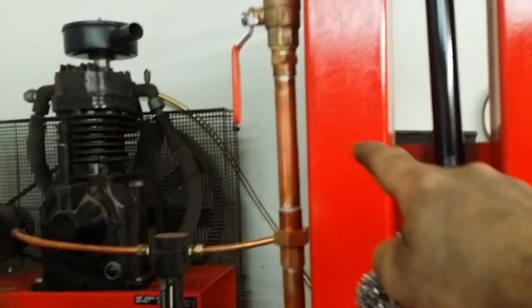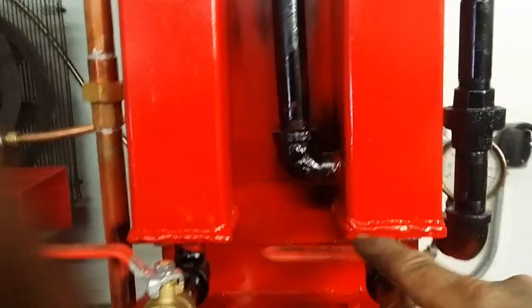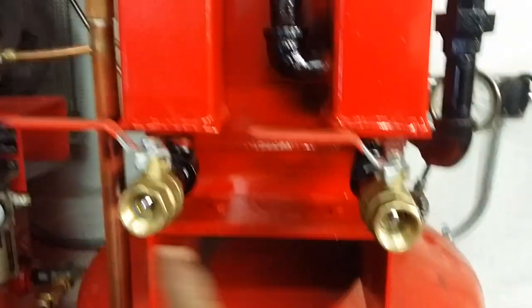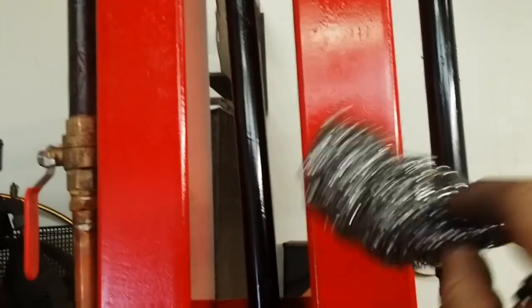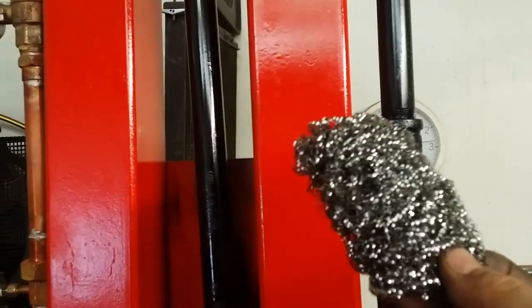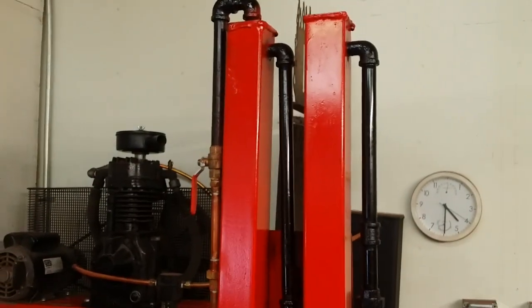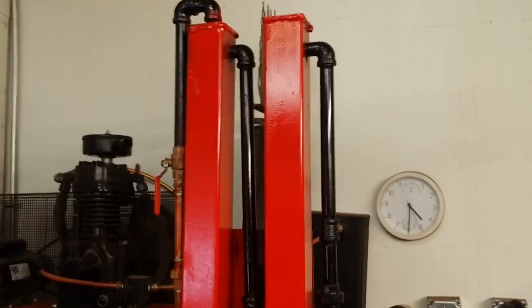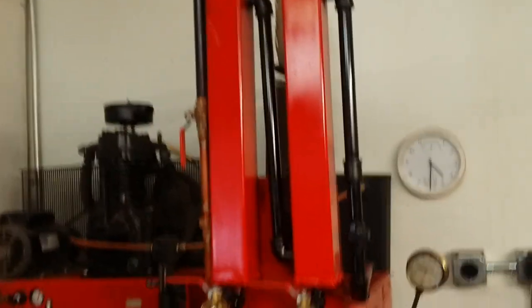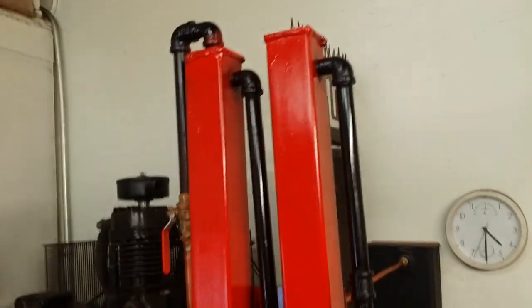As the air works its way up through there, it comes back out the top and drops back down to the bottom of the second chamber. I have two drain valves for the chambers. The second chamber is also filled with stainless steel scrubbies — really inexpensive, you can get a box full at Home Depot. This design is based on one that plain old Bill came up with; his is a single chamber, but I decided to go double chambers — mostly because of what I had on hand and to force the air through separate chambers, picking up efficiency as you go along.